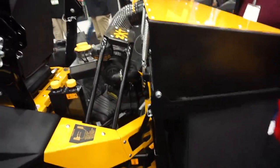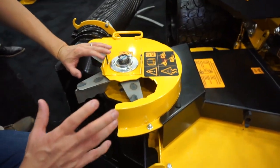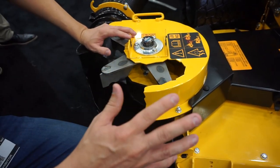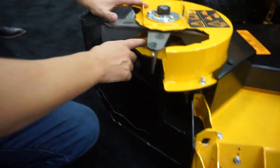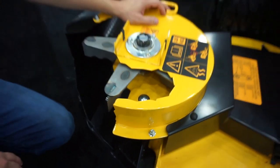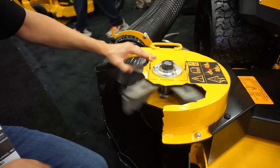The grass catcher is powered. The problem with so many baggers has always been that as soon as you go too fast the deck overwhelms the bagger and plugs everything up. With 40 horsepower, there's enough power and airflow that you'll run into deck cut quality issues when going too fast long before you plug the tube. Unless it's raining, you can run pretty much full speed in eight-inch-deep grass and it won't plug. There's a lot of volume above and below, and we can get a lot of torque to this. On the 72, there's a large pulley underneath, and the impellers are about two-and-three-quarter inches deep.